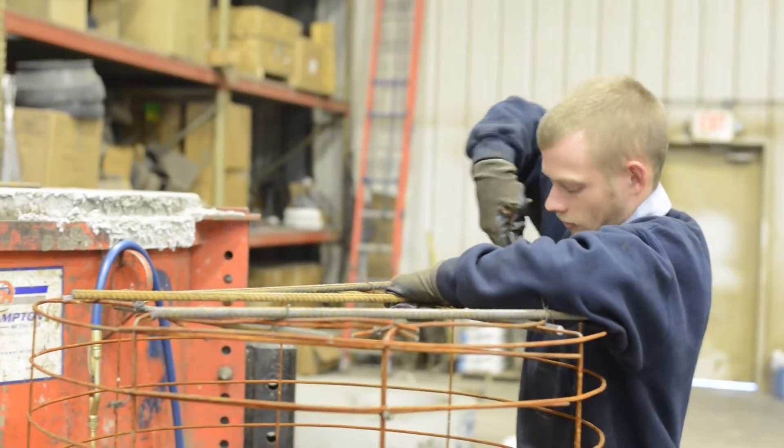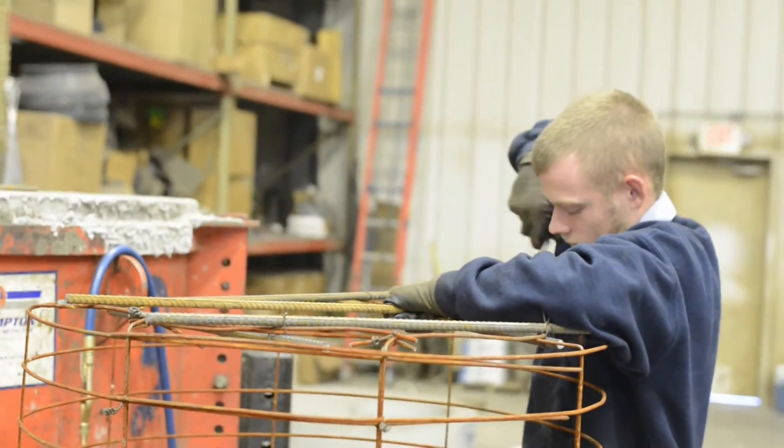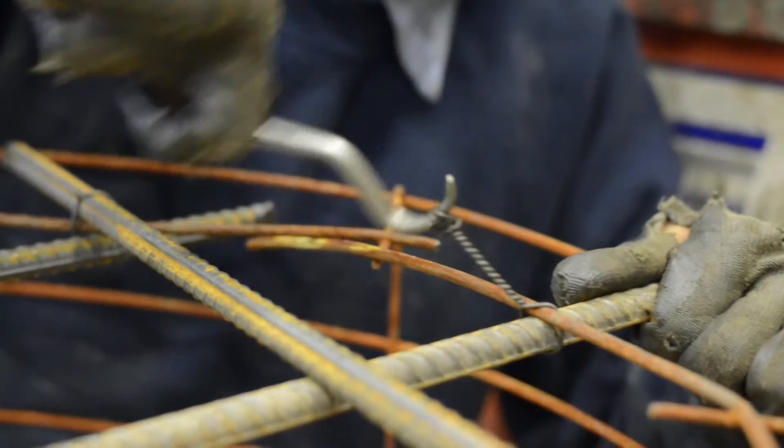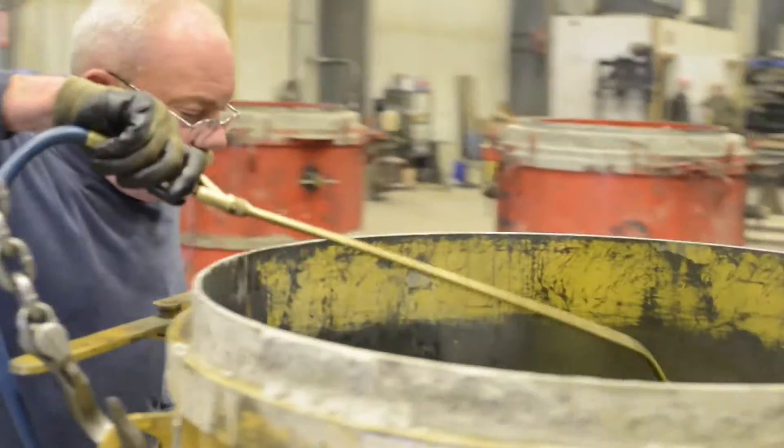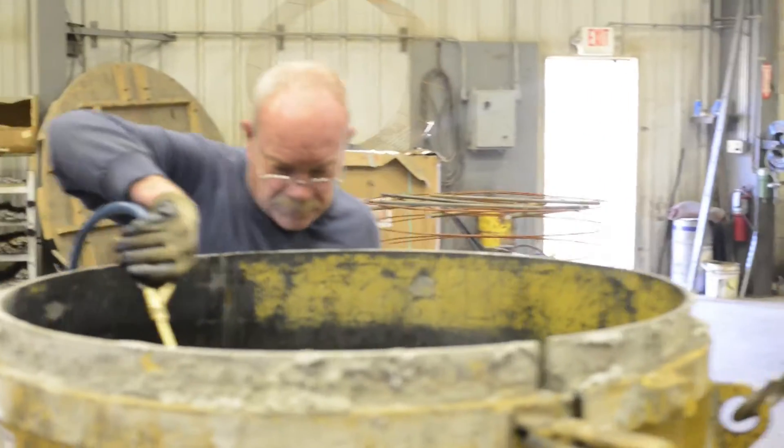Which are behind us. The first step in making a manhole is setting up your wire, rolling it, getting your rebar out and tied onto it. The grease just fills any cracks where the metal doesn't fit real snug, and then the form oil has to be on there or you would never get the metal back out of your form.